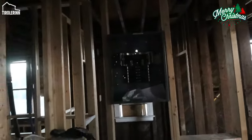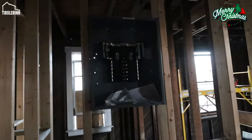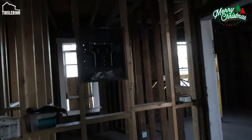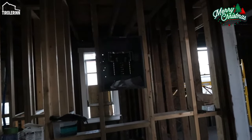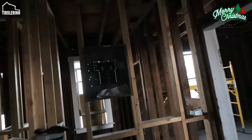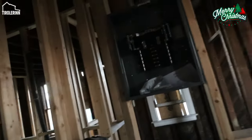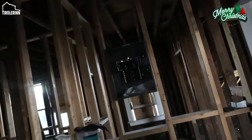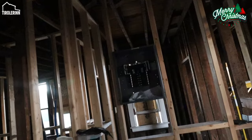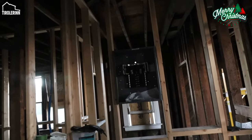We have the junction boxes, or the big sub panels, mounted everywhere, on this first floor and in the attic, so that we can actually start doing electrical. I will run the wire from the sub panels myself. The one thing I will have an electrician do is come and connect all these sub panels to the main breaker panel and actually give me power to the sub panels. But beforehand, I want to make sure I have all the wires finished in the panel, so I don't have to worry about turning sub panels off and basically being safe.